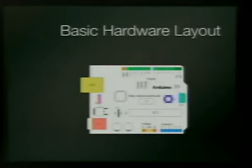So other types of displays. It's a quick and dirty way of interfacing commands. This right here is your actual programming pins. So if you wanted to reflash the bootloader of your chip, or if you had a blank one and wanted to load the bootloader on there, this is the way you're going to do it. You're going to hook your bootloader up to those pins and then run the magic code.